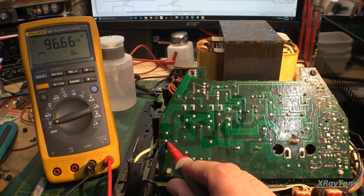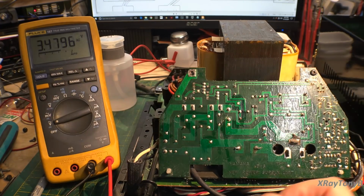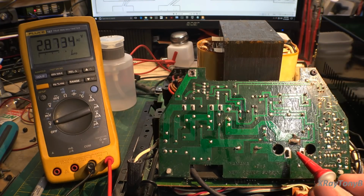And I'm running through a pretty heavy dim bulb tester, but there is a dim bulb in there, so if something shorts, it's going to light the bulb up, and hopefully there's some pretty heavy components in here. It won't cook anything on the board. The bulb will take it. But there's enough current, this is a 110 watt bulb, that it shouldn't interfere with the triac if it wants to fire up.